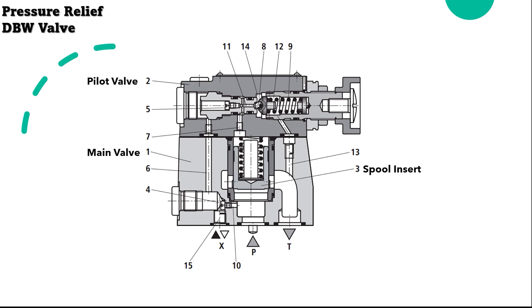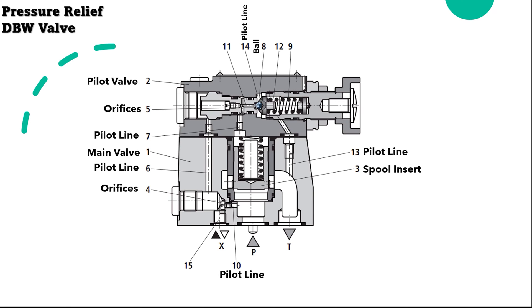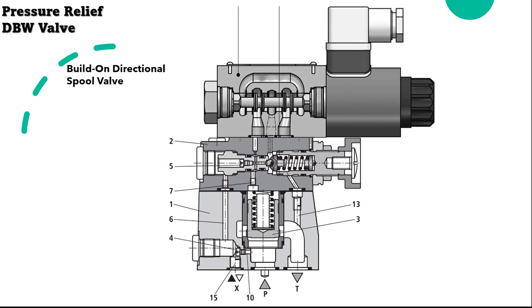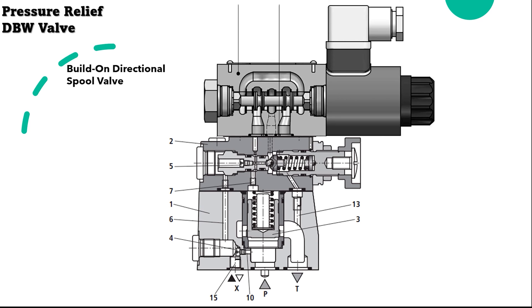The main spool restricts the main flow of oil due to balance counter pressure. The orifice restricts the flow path for the drain side. The pilot line is a small path to pass oil for the control element. The ball opens against the spring tension. The spring can be adjusted for set pressure. The spring chamber is where the pilot spring is installed.